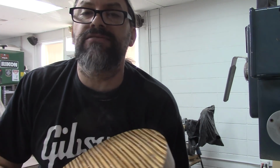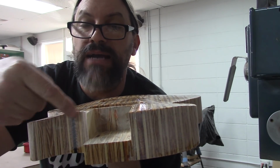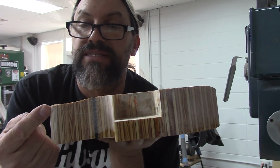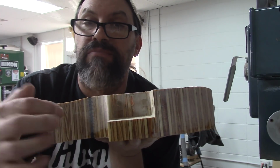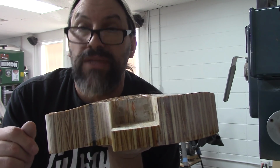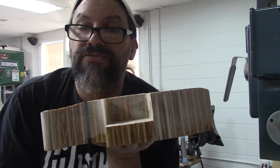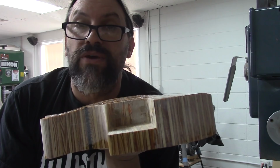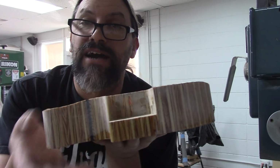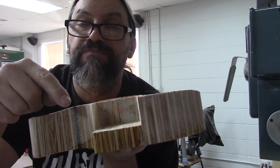The other thing is there's a couple different ways depending on when your guitar was built. If you have a Les Paul, sometimes it will have a flat line from the back of the guitar to the top of the guitar. The distance there will be the same and the binding will just follow that line. If you have a vintage one or one that's a reproduction of a vintage one, it will follow this arch right here. Now, if we're going to follow the arch right there, we need to use a different tool than what we're going to use today, which of course is my beloved pin router. And in that case, we're gonna let the body rest on the table, and we're just gonna buzz this all off in a couple of passes. And it's gonna be cool.